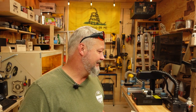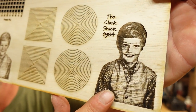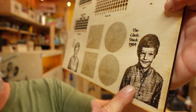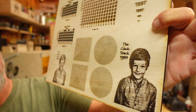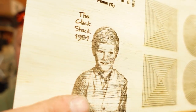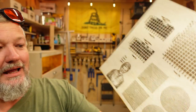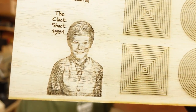Settings aren't that complicated, and maintenance shouldn't be too terrible — the automatic air assist should keep everything clean and running smooth. I also did some photo engraving with this machine on quarter-inch Luan. The first attempt I ran a little hot, so after touching it up with a sander it had a raised 3D effect — kind of like 2.5D. Then I backed the power down a bit for something smoother and less destructive to the material, and that's what I got. It's a black-and-white photo from back in 1984 — I was rocking the vest, okay.